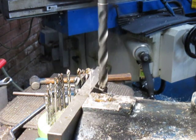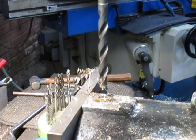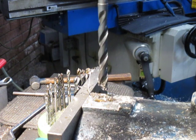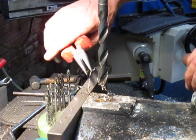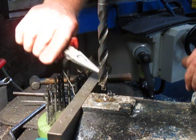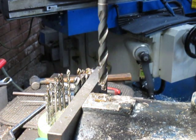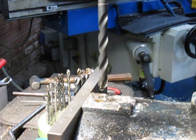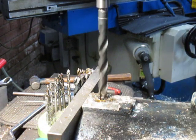As you can see, we're getting flaking, threads are starting to flake. And that's what we want to accomplish. So we'll just keep moving on. See how it's starting to pull that thread out. So we'll just keep working, and at some point in time, should probably try and grab it and take it for a walk further down into that virgin territory.